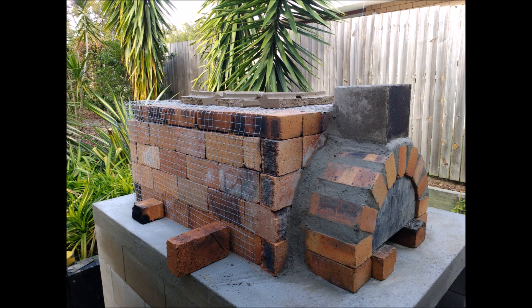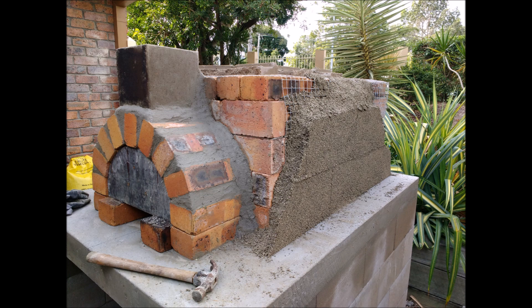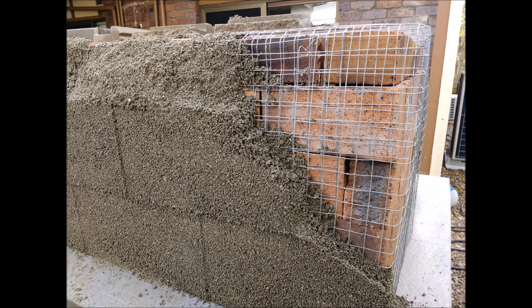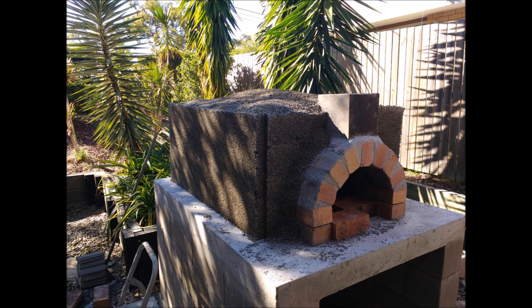There's the plywood arch support for doing the bricks. I've put some steel wire mesh over the oven because the next step is to insulate it. The insulation is vermiculite mixed with concrete cement powder — you can see it close up. You can get it from hydroponics stores; it's a natural mineral with really good insulating properties. So vermiculite, some cement powder, and water makes this light, fluffy insulating cement mix which has two purposes: it seals off the oven to stop hot air escaping, and it also insulates. It's about 50mm thick, the layer I'm putting over it — a bit thicker on top, up to 80 or maybe 100mm in the center. I just coated the whole oven in this vermiculite and cement mix.